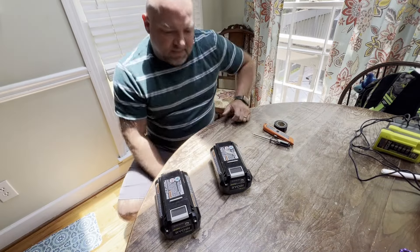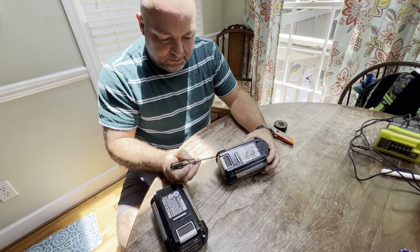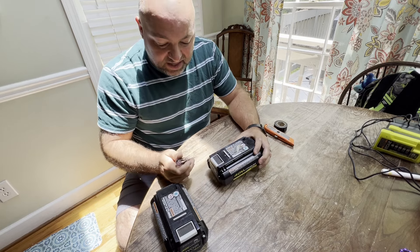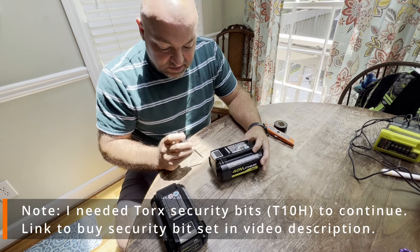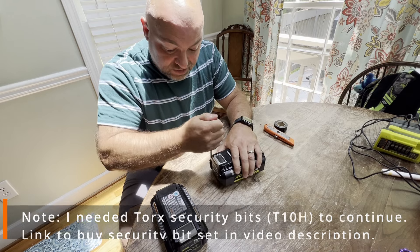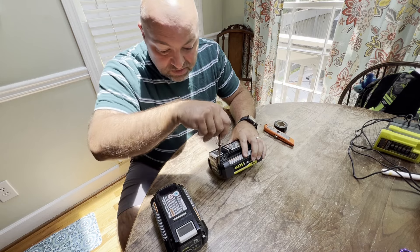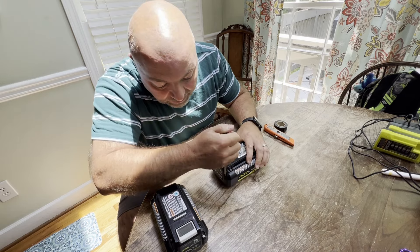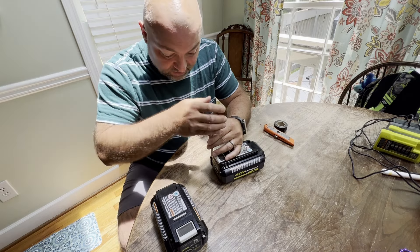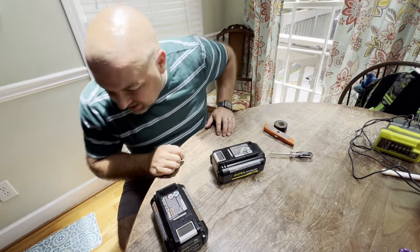What we're going to do is take a Torx bit. Generally you're going to have some tabs — little black plastic pieces — that you'll need to pop off with a small flathead screwdriver. Most likely you're going to have the safety screws, a T10H security screw in there. I think somebody has messed with these before, so I'm going to try using a standard T10 — but we'll find out shortly. I'm not able to get in there since I don't have the T10H model to loosen those security screws, and there's a little raised bump in there that requires that feature. So that leaves me with a little bit of a bind — I'm going to have to stop and pick up once I've got that T10H.